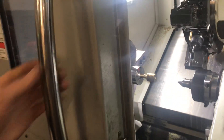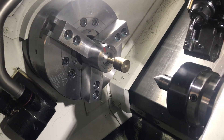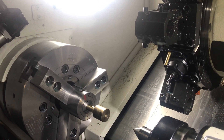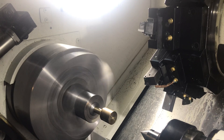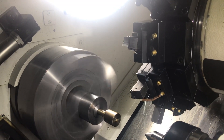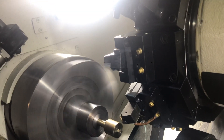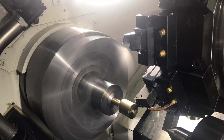Keep it open just a smidge so we can see what's going on. We'll turn the coolant off for this one piece. Now you've got to get your turret back in the right starting spot because we index that thing around. What kind of RPM do you have, Dave? 1,200 RPM. The bronze chip speed is right about 120 SFM there.